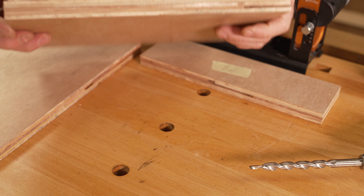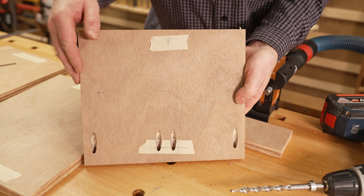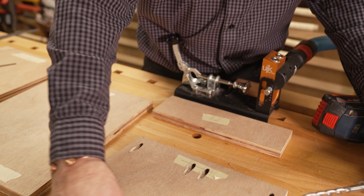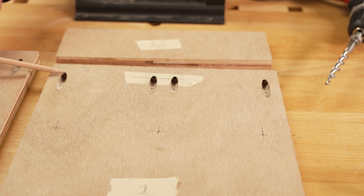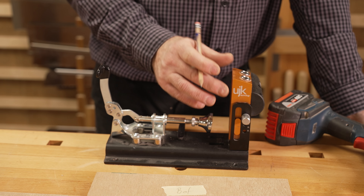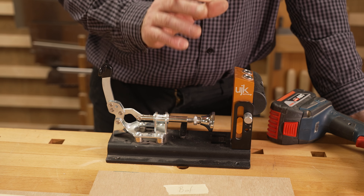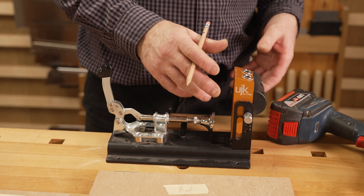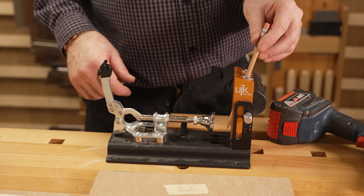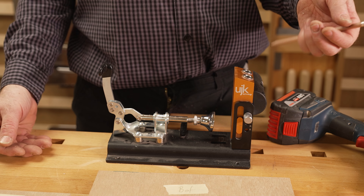First board done - drilled. They don't quite come all the way through, so you're not going to get a hole showing through the face. Nice clean hole coming down. We have a location in the bottom where the screw tip goes through. The tip of the screw is actually designed to drill that out. Inside the jig is an aluminium block with a hardened steel insert - that guides the drill down nice and accurately. There's also the extraction point which gets rid of the waste very effectively. The drill presents everything at an angle, which also increases the strength because you're crossing the grain fibres a bit more - especially in real timber.